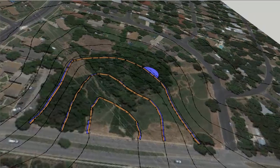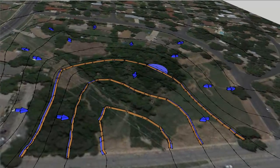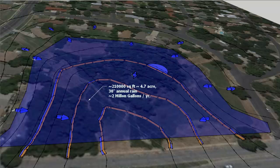These are two-foot contours. We go down into the earthworks. There are two-foot contours and various spillways. As the swales fill up, they'll spill into the next swale, fill up, and then spill into it, keep flowing down to eventually the drain. I think it could probably easily be filled up — if it was closed off here, it would definitely make a pond. If we look at the water flows, we can get a rough idea of how much water flows into this area. You can see it flows out along this ridge and flows in on the inside — this is a ridge here, and here's the catchment. Roughly two million gallons per year for a little less than five acres.